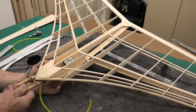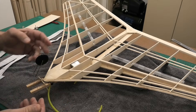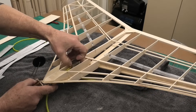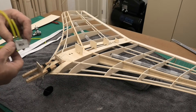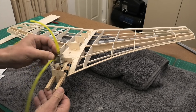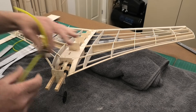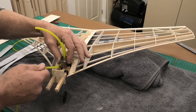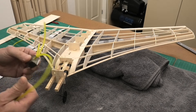The tank is a little bit way back from the engine - about 100mm back - but I don't think that's going to be a problem. These are great engines, it will draw that fuel up without any problem. I have tested this on the test stand and checked it will run OK and that this tank is a good size. It's a 10cc tank. The other option was to put the tank between the bearers, but the 10cc wouldn't fit - it's too wide. I could have put a 7 or 7.5cc tank in, but I would have had to cut out quite a lot, so I think what I've done is probably a good solution.